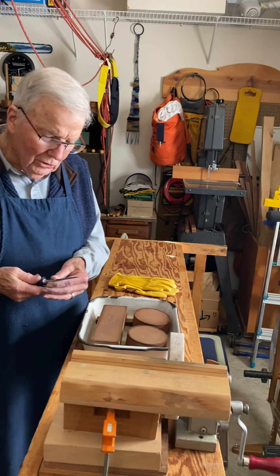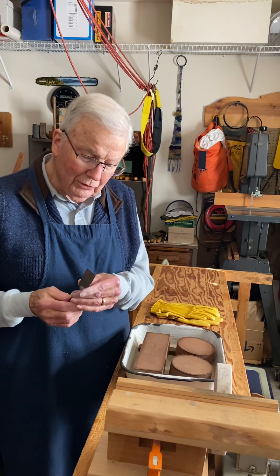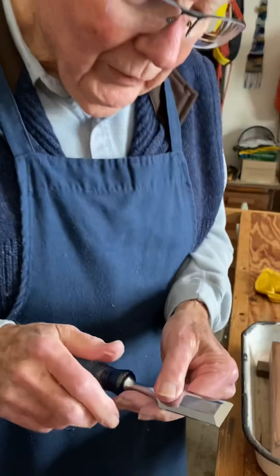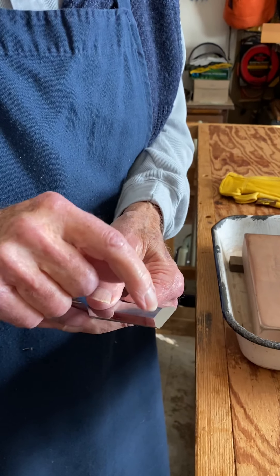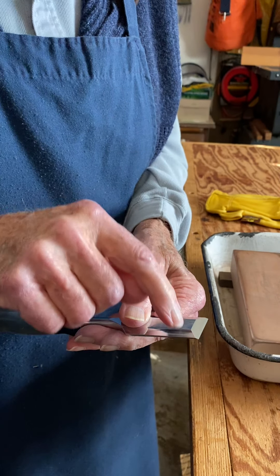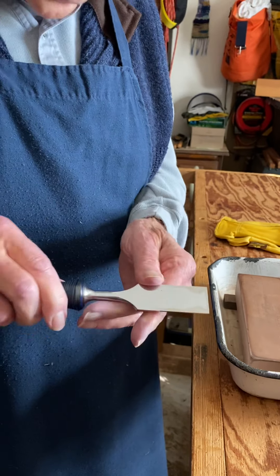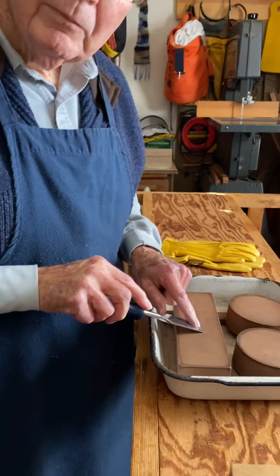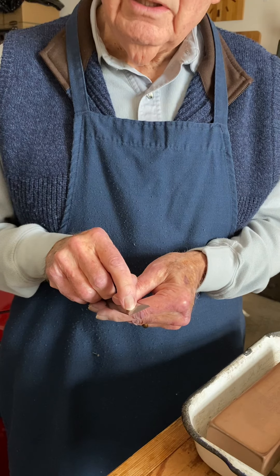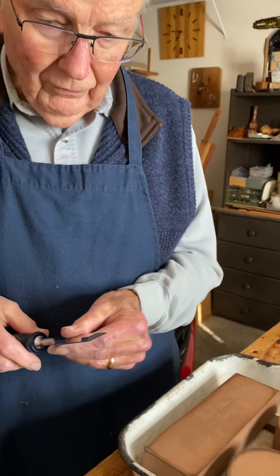I showed the advantage of using a six inch diameter wheel — you can see a sheen on the front and the back of the chisel. That is made possible by the fact that the wheel makes a concave groove into the front edge of the chisel, and then when you put it flat on a sharpening stone, it only grinds the tip and the heel.